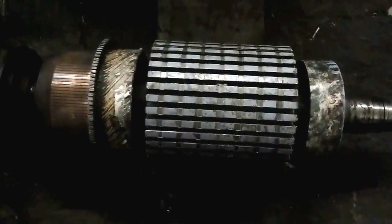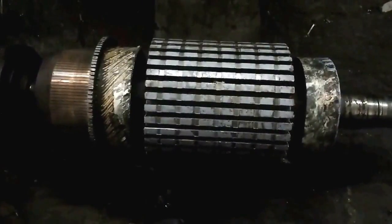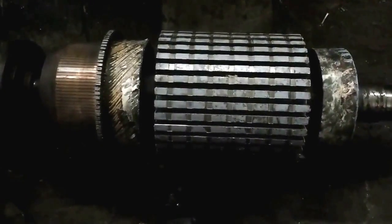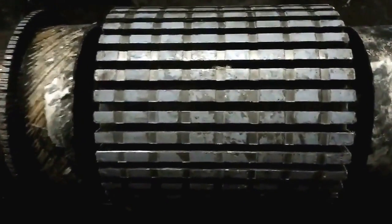This is the continuation of the 300hp DC motor. We found that the armature had faulty windings, so we went ahead and decided to rewind the entire rotor windings. So far we have dismantled all the windings. From the slots they have been removed and the commutator has been cleaned up. The commutator will go through some more repair to make sure the segments are very cleaned up. Right now you can see that this rotor has got 37 slots.